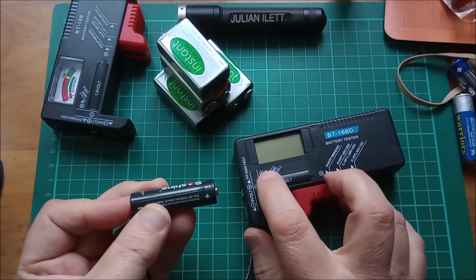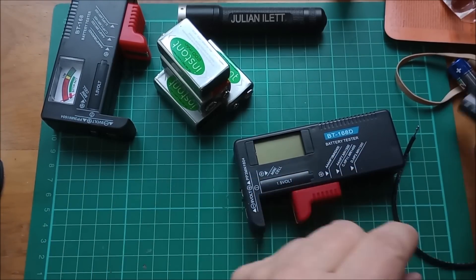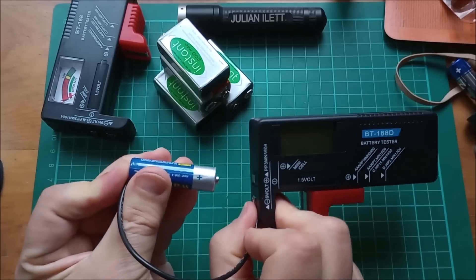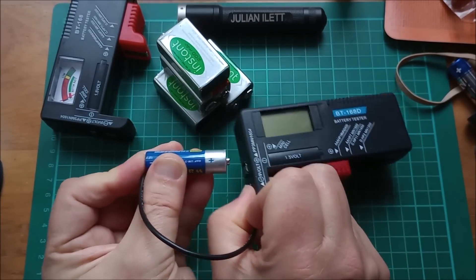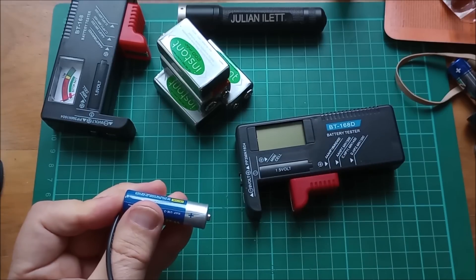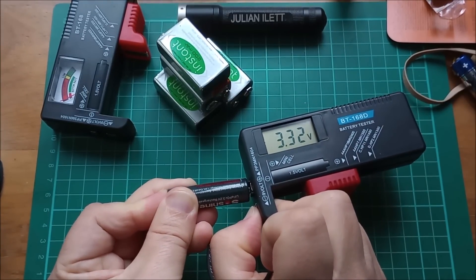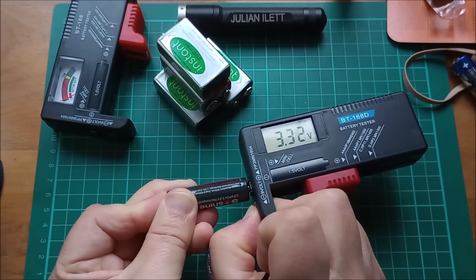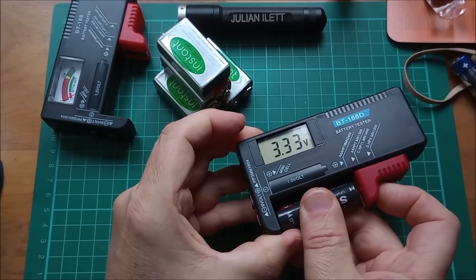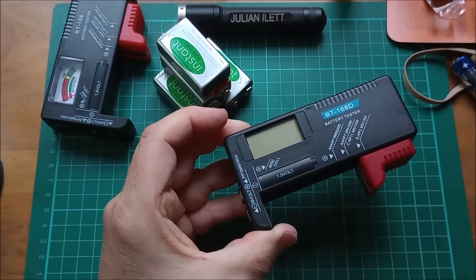I've got a feeling there's a 3 volt regulator just inside the 9 volt connections. My guess is if I use a 1.5 volt alkaline on the 9 volt input, it just doesn't power up because it cannot generate the 3 volts the microcontroller needs - it's going to be 3 or 3.3 volts to power up the display circuitry. Interestingly, when I put a 3.3 volt battery on the 9 volt input I get 3.31 or 3.32, and on the 1.5 volt input I get 3.33 - fairly similar but slightly different because they follow completely different paths into the display circuit.